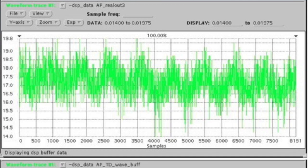So that's crazy, because there's noise in there, there's 60 hertz noise, there's all kinds of noise in there. You don't know where it's coming from, especially when it's a really, really tiny signal from the CMR test. So 0.707 times peak gives you the RMS for a single tone. And I can prove that a million ways from Sunday.